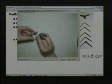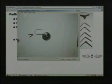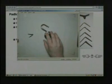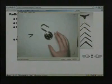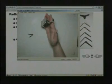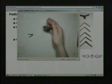It just pushes the bar right out of the way. It's no different than slipping a credit card in a door jamb, because the spring-loaded bar just feels something pushing on it and says, oh, this must be the shackle coming down. I'm going to get out of the way now. There you go.